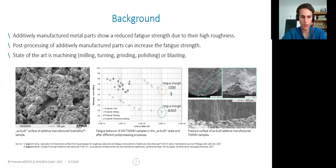And why is this important? We, and especially our design team, try to get the best out of additive manufacturing by redesigning parts, using tools like topology optimization, which aims at getting rid of excess material, making struts thinner, making parts lighter, reducing costs. This can lead to some positive business cases for this still pretty expensive technology. And this works really well for statically loaded parts. But if you have parts that are dynamically loaded, the low fatigue strength of additively manufactured metal parts comes in.